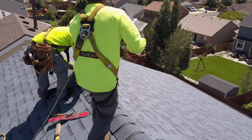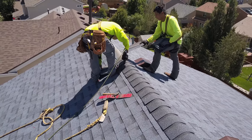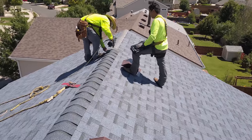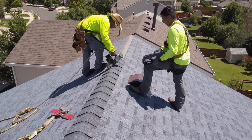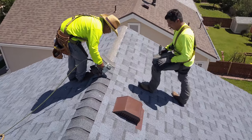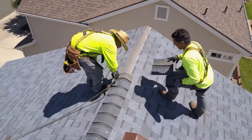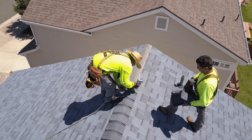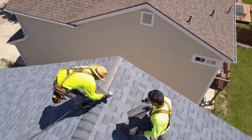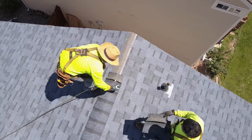Storm nailing means you're actually installing the nail in the face of the top of the ridge cap or hip shingle. We don't want to do that from the beginning. Here in Colorado on the Front Range where we constantly get high winds, we've determined that when we install four nails per ridge cap properly and space them correctly, those ridge cap shingles will hold. Many manufacturers will give a 130 mile per hour wind warranty with their product when the right ridge cap and proper shingle are installed. However, that warranty doesn't really apply to hurricane-level sustained winds.